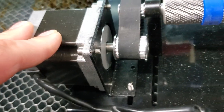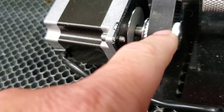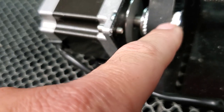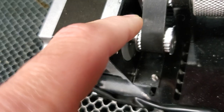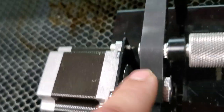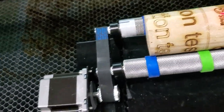Mine is set to 5000. Number two: the other two numbers you're going to need are how many teeth are on your pulleys. You don't want to measure the diameter — that's not a really good indicator of the gear ratio. Count the teeth. How I did that was I put a mark on one tooth and then started rotating it and counting the teeth as I went around, and then the same thing on the driven gears. This one was a 20-tooth, these were 12-tooth.